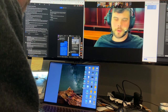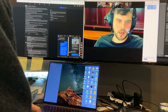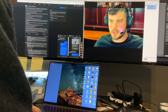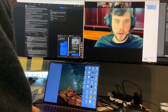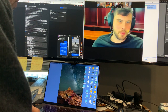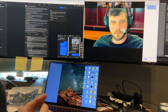You have about a 20% margin. Okay, so if it's a 20% difference, then yeah, you can. I don't necessarily recommend that, because what you'll get into then is a potential to have one battery beneath 3.5 volts per cell and the other above, and that battery beneath will have a very hard time supplying the current needed, because once you get beyond 3.5, it slows down. You run into problems, yeah.